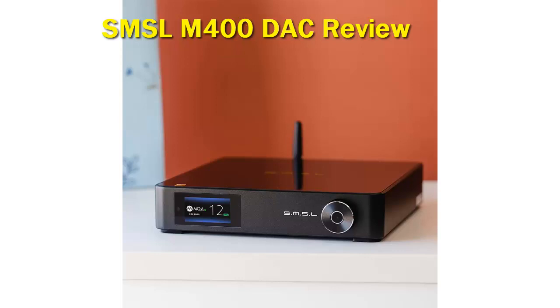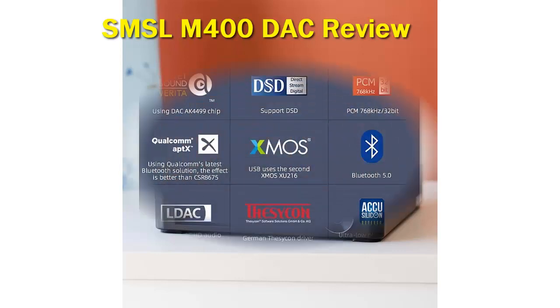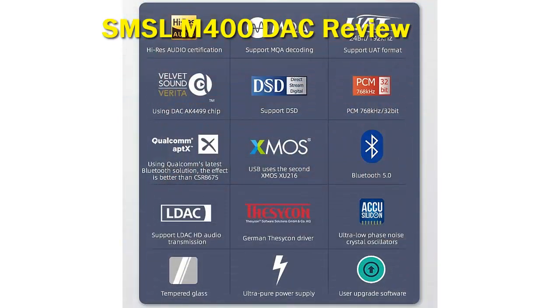SMSL will let you choose between using M400 in a DAC mode with fixed-level outputs, as well as in a preamp mode with 80 steps of attenuation. Furthermore, there's a selection of digital filters you can use. Note: digital filter is a necessity of Delta Sigma DA conversion, and it's always used in a DAC, but most of the time the manufacturer chooses the one, and it's not possible to change it. I'll not go into details about sonic differences of different filters. Try it for yourself and decide which one suits you the best.